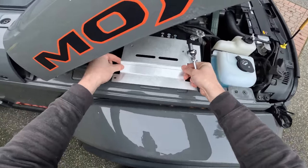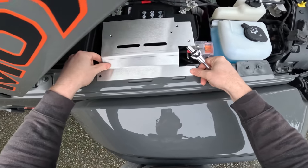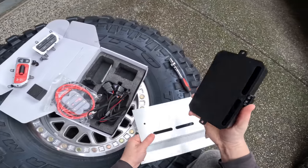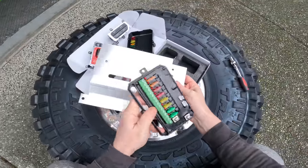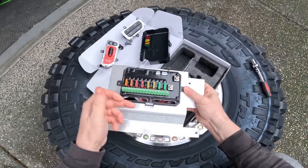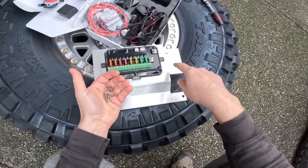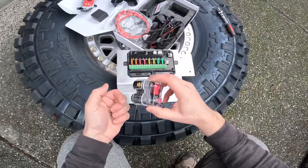You can see now how this is going to mount — just like that. We even have some extra fuses in the cover in case we blow one. We want our fuses on the side with the two slots, because that way we can route any wires coming into this underneath and we don't have to see anything coming through the cover. These are all pre-threaded, which is excellent. The other piece we need to mount on here is our breaker.